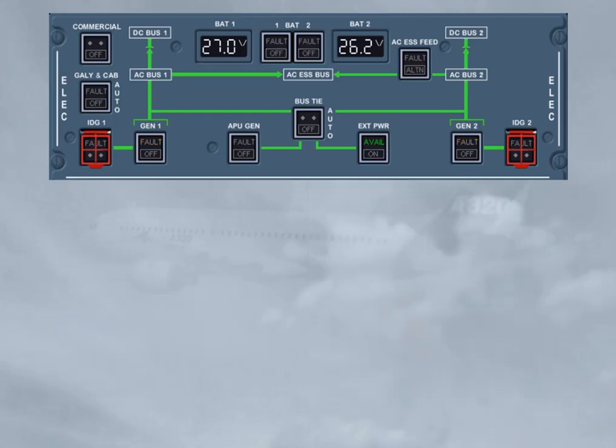But before powering electrically the aircraft, if it has been electrically supplied during the past 6 hours, the related battery voltage will be above 25.5, ensuring a battery charge above 50%. So the batteries must be switched on. Now, if the APU has to be started on battery only, make sure to start it within 30 minutes following the battery selection to on, because the charge of the batteries will be less than 25% if they still supply the aircraft after 35 minutes.